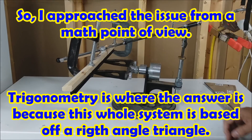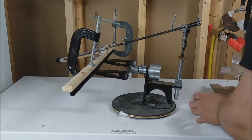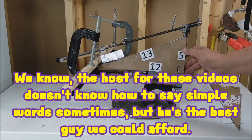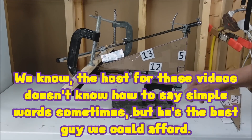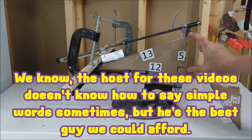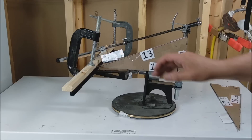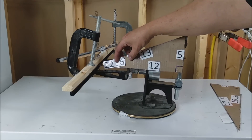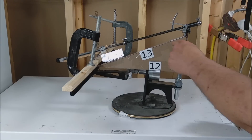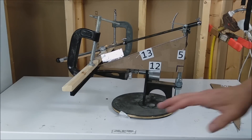Here's a sharpening system. We've got a flat line back here, a 90-degree angle, and you come up — so it's like putting on a triangle. If you use trigonometry, and you know that this is a 90-degree angle and that is flat, if this dimension stays the same, when the length changes the angle down here must change. So the angle right now is 22.6 degrees — if you've got 5 inches for side A and your hypotenuse is 13, that must be 22.6 degrees. There's no way around it.